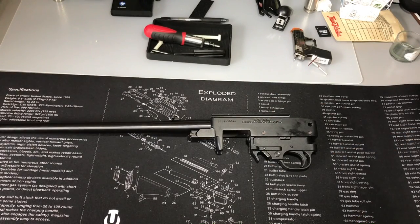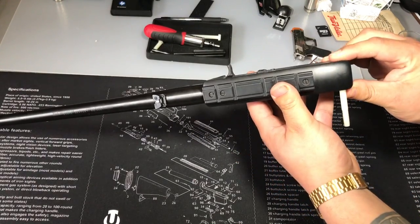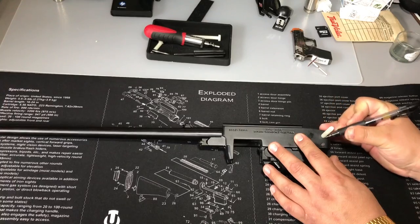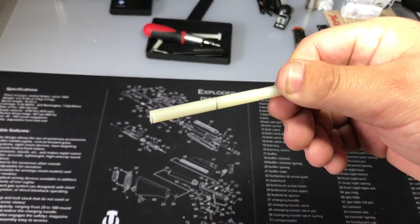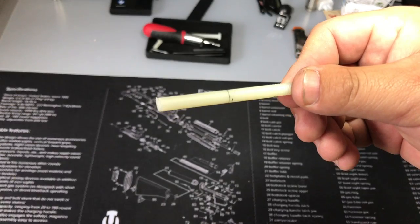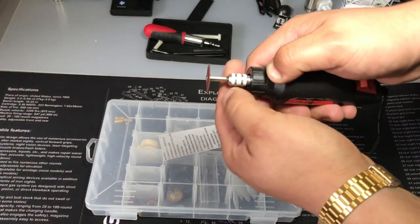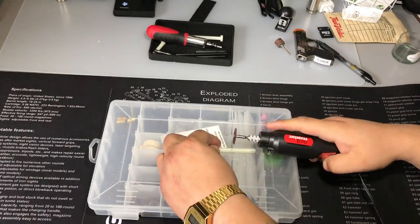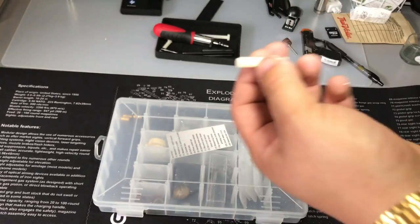The easiest way I've found to make sure you get your bolt cut to the right size: get your receiver, stick the bolt through the buffer pin hole, make sure it's flush on this side, turn it around, grab a pen or marker, and trace around the bolt. Once you've traced around your bolt, repeat the first step and cut along the line. I actually went a little further out so I can sand it down in case the cut comes out crooked. Cut the bolt to size, then sand off the burrs on the end to make it smooth.